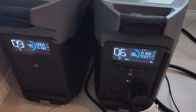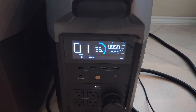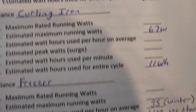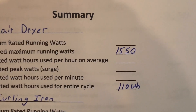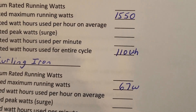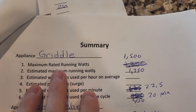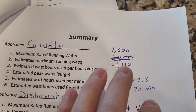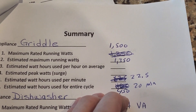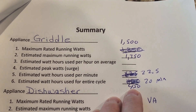Just a few hours left for our simulated power outage. My wife is going to blow-dry her hair. The hair dryer is rated at 1550 watts maximum running watts, but it should only take about 110 watt-hours out of the battery based on the amount of time she generally uses it. Then my wife's going to cook up pancakes, bacon, and eggs on our griddle, which is rated at 1500 watts. Based on the temperature she uses, it'll be about 1350 watts, and for about 20 minutes — we'll use about 450 watt-hours out of the battery bank.